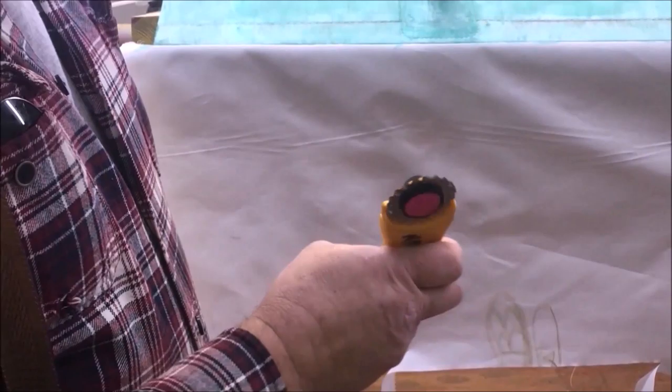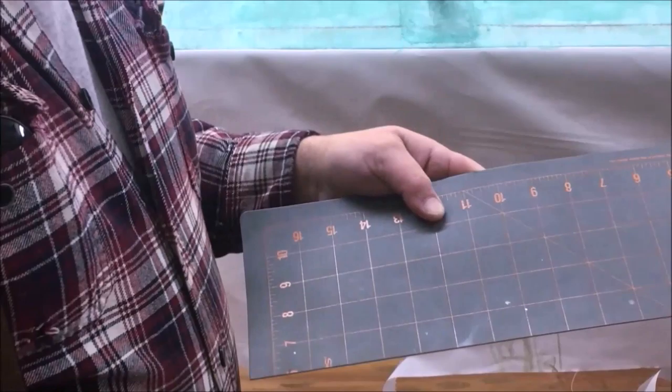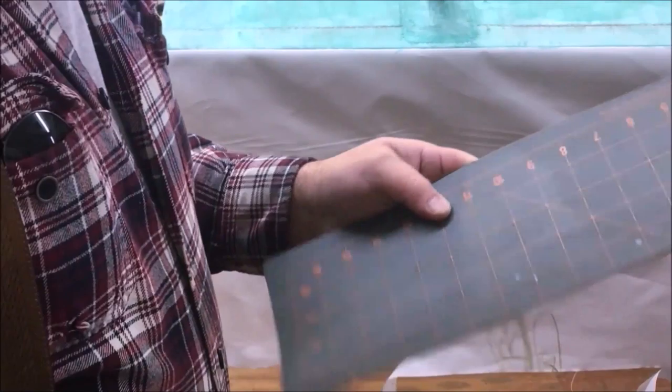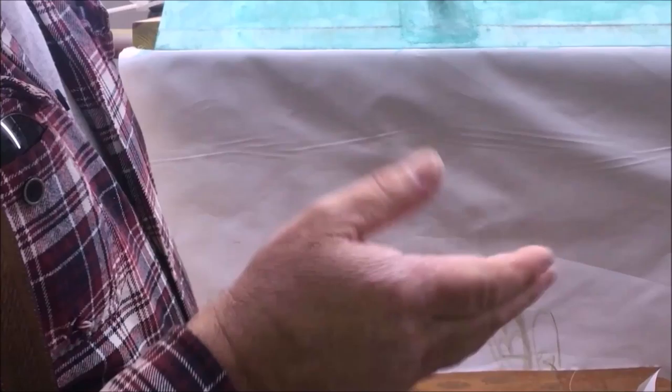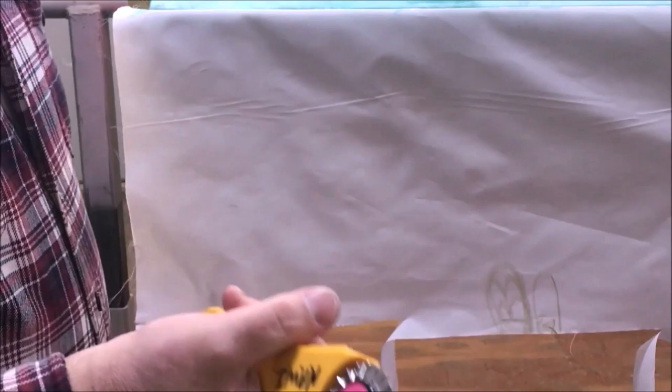It works with a pad. You roll it along on that pad with the fabric between it and the pad, and it is very controllable. It's very easy to do, and it's pretty darn quick. I like a pinked edge because it makes any little inconsistency a little easier to be hidden. And it also gives us more surface area for the glue to bond to. So anyway, we're going to show you this method today because that's what I did on the rest of the airplane.